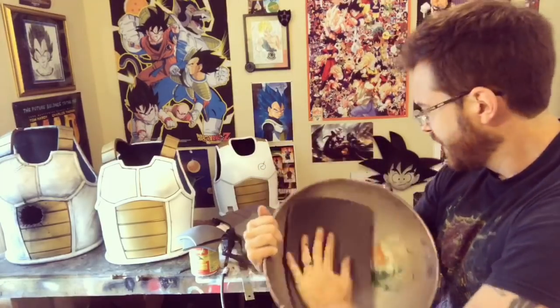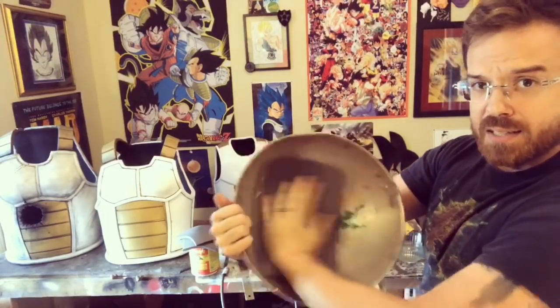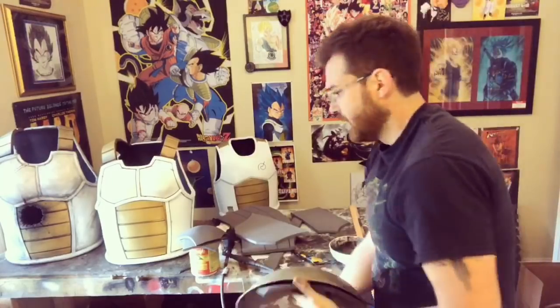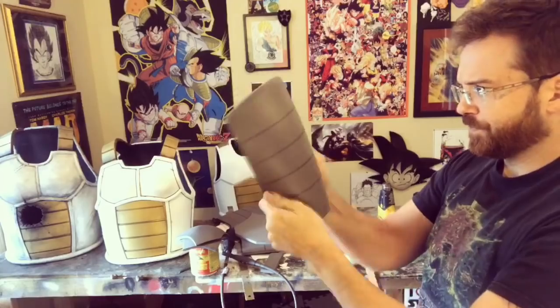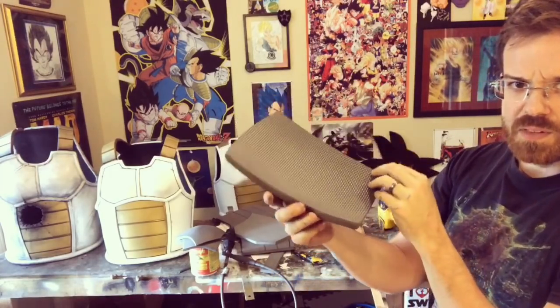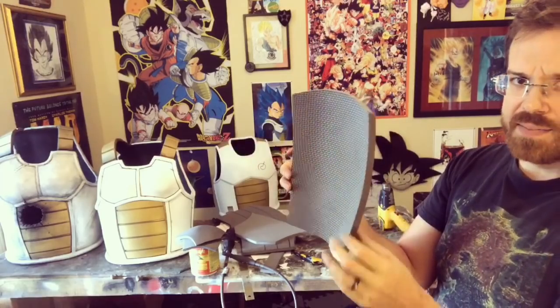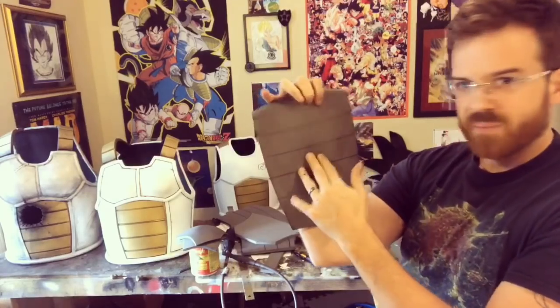Same with this. I want it to take that shape. Moving across the metal, it's gonna help cool it. All right, we'll go ahead and twist like this. So now I created this dome shape. You can see it, it's like the satellite there. It's got a convex this way and that way. And that creates that pop. It wants to come back to that shape.